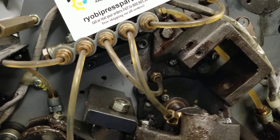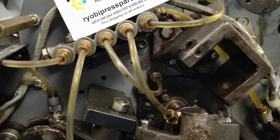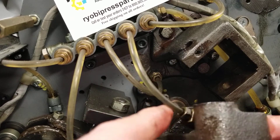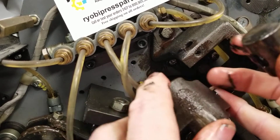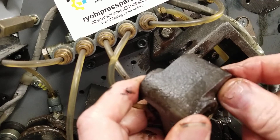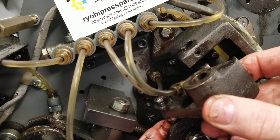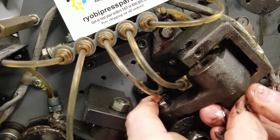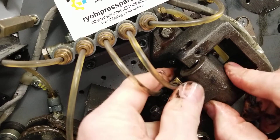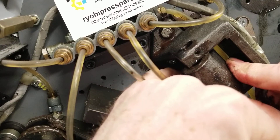To put this back together, you would take your new bushing and slide it up inside here with the flat part away from you, like that. Then take this cam follower and lay it in the pulley. Then push this forward. Now you can't push that in there because the hole has got to be lined up — that's when you take your pinky and get around the back side.